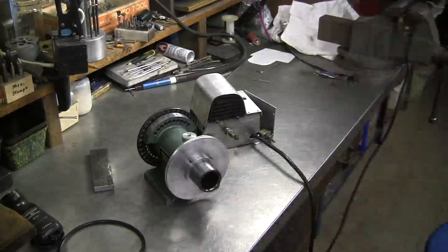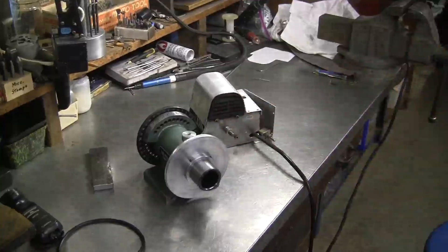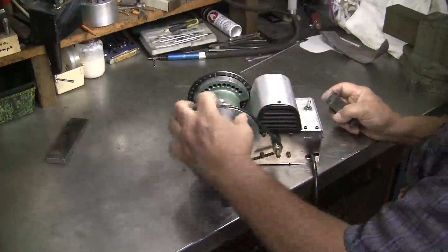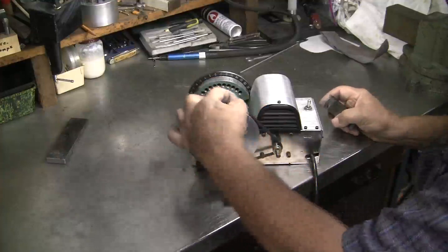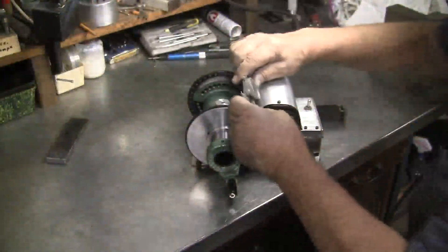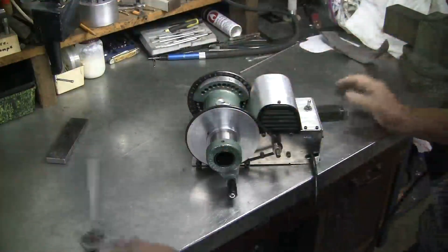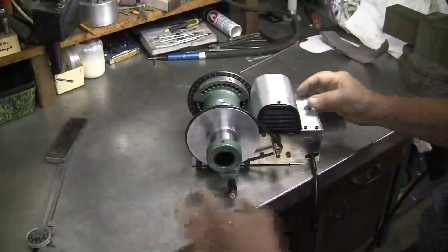It's a short video on what I did, and you're welcome to the drawings and the STL file for 3D printing the louvers or vents. It's a number 354 O-ring. A person could cut that groove with a 202 diameter cutter instead of 210, because this O-ring stretches a little bit and it's probably not 210 in diameter — it's actually 202. So you could use a 202 diameter cutter and the O-ring would fit exactly.